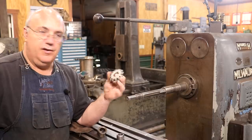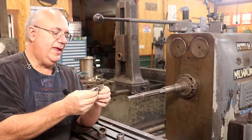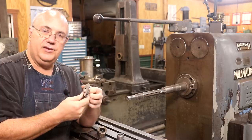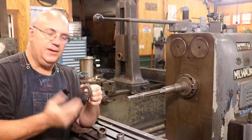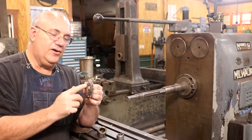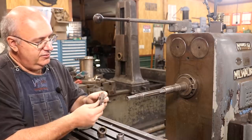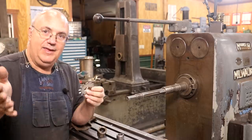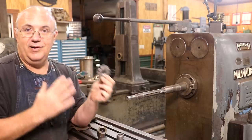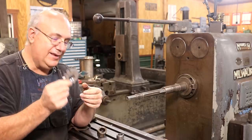The cutter we'll be using is an involute cutter. An involute is the gear shape — the shape of that gear tooth or the void between the gear teeth that we'll be cutting out. These involute cutters come in a set of eight for every gear pitch. The size of the teeth is measured in a pitch; this happens to be an eight pitch. There are actually eight cutters to choose from, and you use a different cutter depending on the number of teeth, which approximates the shape you need to give you a usable spur gear. As luck would have it, I've got a cabinet full — probably a couple hundred of these involute cutters collected over the years. But I had seven of the eight cutters for the eight pitch, and the number three cutter, which is the one I needed, I didn't have.